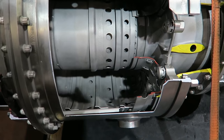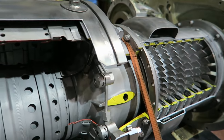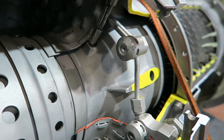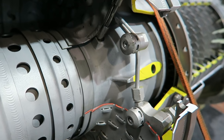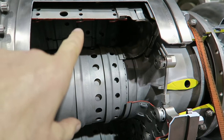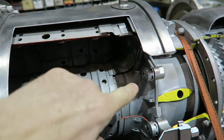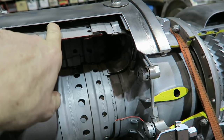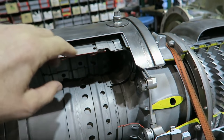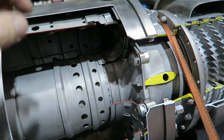It has a single annular combustor with, I think, nine fuel nozzles. You can tell by the fuel nozzle right there that it burns liquid fuel — if that isn't immediately obvious to you, look at my videos on fuel nozzles. You can see the space here between the combustor liner and the outer case, where a lot of air gets forced around the outside to come in through these holes to both direct the flame and keep it inside and away from the outer case.